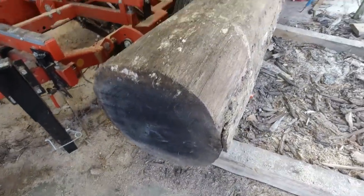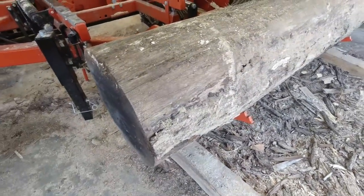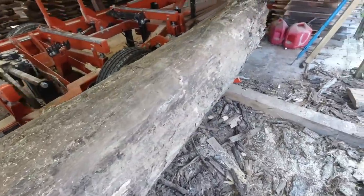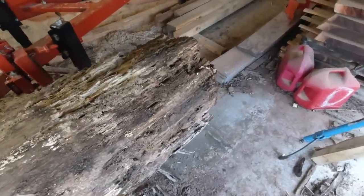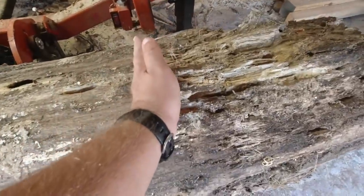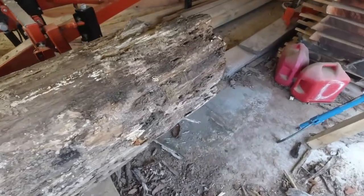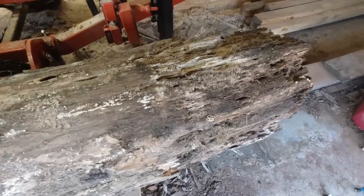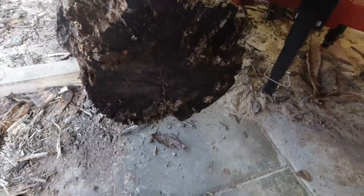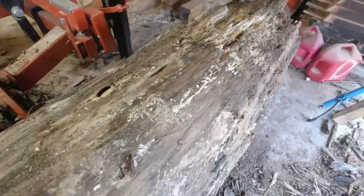Here's the log. This is red oak. It's about 10 feet long — we'll make it shorter in just a minute. As you can see from the outside where the bark is missing, it looks pretty bad. A lot of holes right there from insect damage, pretty terrible on the outside. And on this end it gets worse — there's a lot of rot going on. Just really bad right there. I'm going to come in here with my chainsaw about right here, and that's going to leave us with eight-foot boards today. That's what I'm after. That will also tell us what this timber may look like on the inside when we get rid of this end. Hopefully it's going to be solid. There'll be a lot of rot in the sapwood, but the middle should be okay — but I don't know. That's pretty bad right there. I'm starting to rethink this one, but we'll throw it on the mill and see what happens anyway.